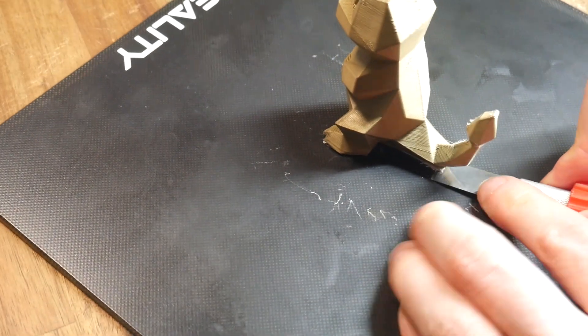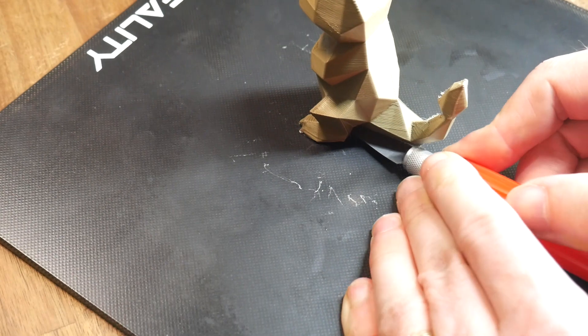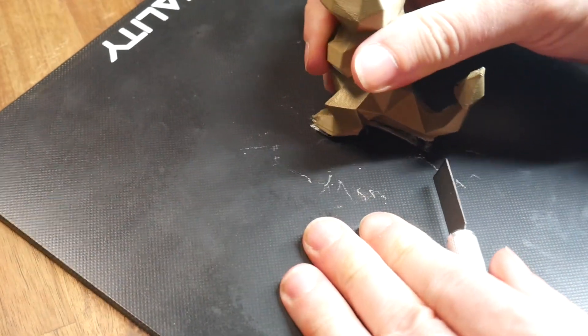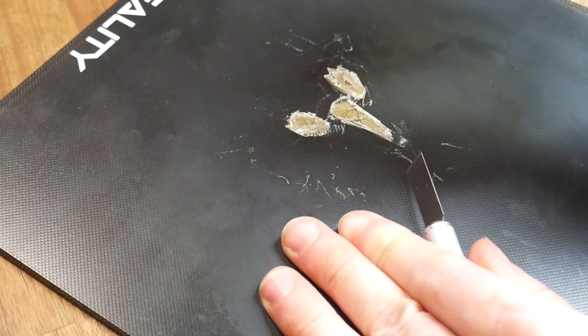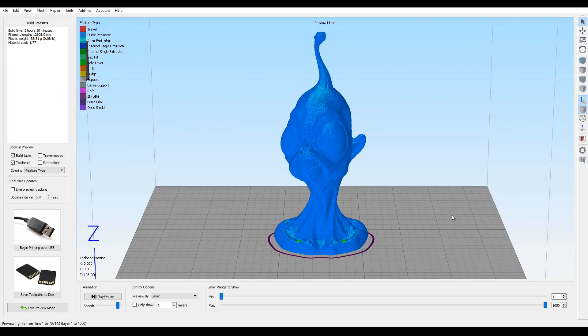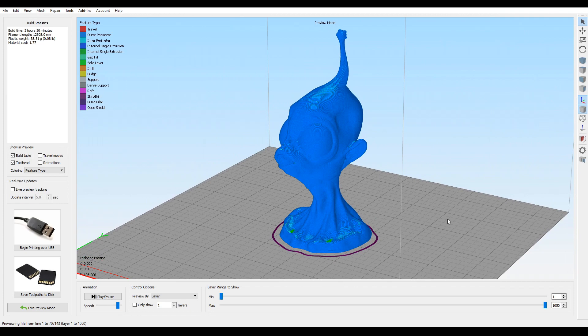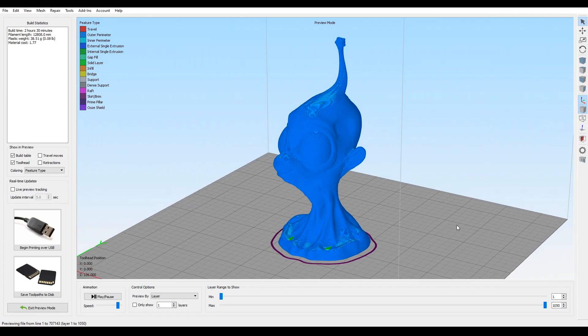Even after the ultra base style bed of the CR6 had completely cooled it was very hard to remove this object. After spending a solid 5 minutes with a flat blade it finally came loose, but it was more that I'd sliced off the lower layers which were now missing from the underside of the model. I decided to switch to a printer with a flexible build platform and therefore switched to my Ender 3. For this bust I lowered the hot end temperature from 210 to 200 degrees and also turned down the layer height to 0.12 millimeters.